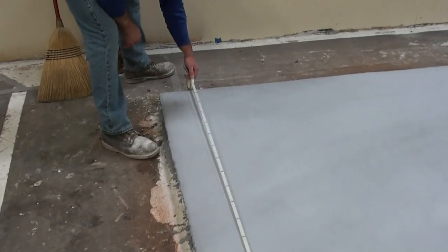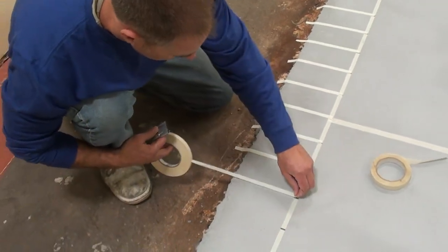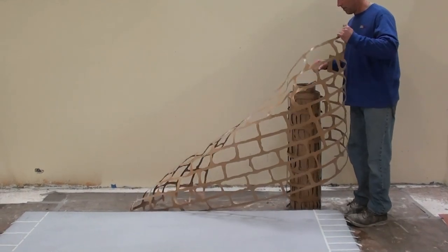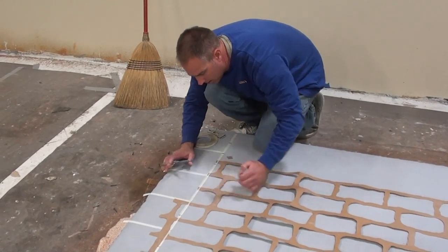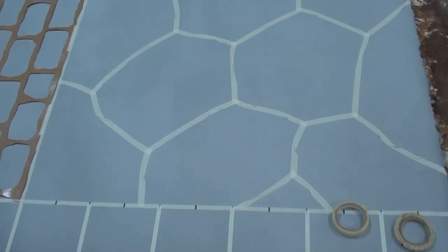At this point I'm measuring out for a brick border. The brick line tape is lined every four inches, so creating brick borders is very simple without having to use a tape measure every time. This product is a paper stencil — some come with sticky backs and some do not. This particular product does not have a sticky back, so I cut it and tape it into place.